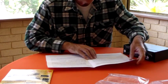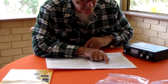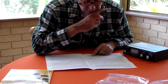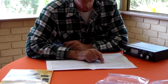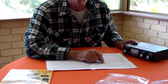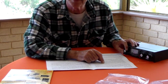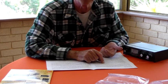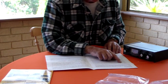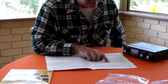The instructions say: set the transmitter and antenna controls to position five - they came out of the box set to five. The tuning capacitors are half-opened at this setting. Rotate the inductor until maximum noise is obtained with the transceiver in receive mode. Never transmit while changing the inductor setting - a lot of people will just put RF into it and click click click and it'll burn out the rotary switch. Don't do that. When transmitting, a steady-state carrier - adjust the antenna and transmitter controls for minimum SWR.